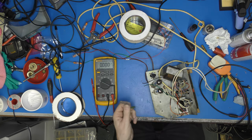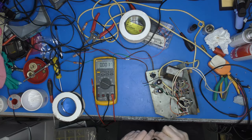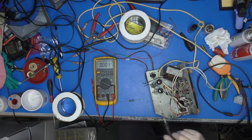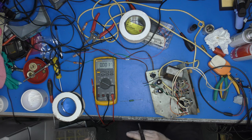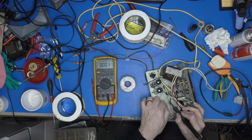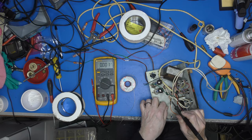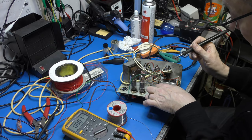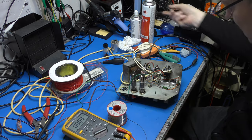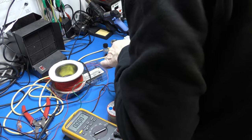Right, well, all my resistors seem to be 100 ohms in that sort of range, so I've got another one. And I'm just going to tack that again temporarily in series with the power supply. One thing I have noticed is there was none of that hum we had when I initially switched it on. So that's good news. Right, well that's nasty, isn't it? Let's power up again and see what we get to.